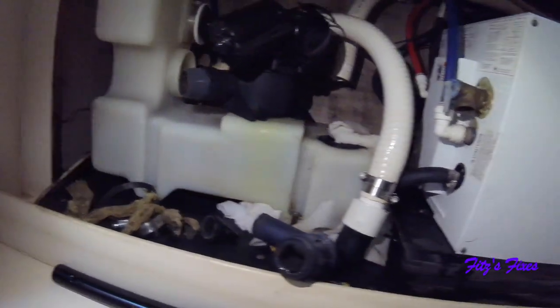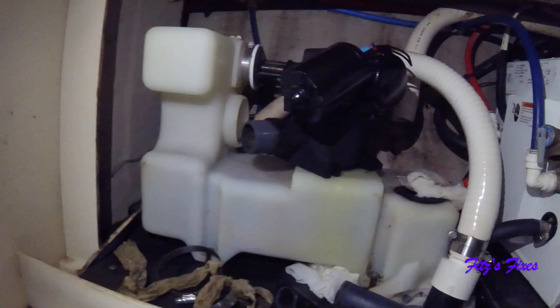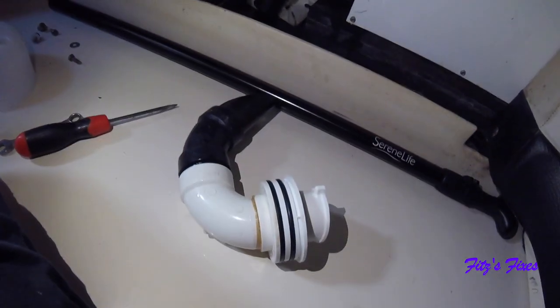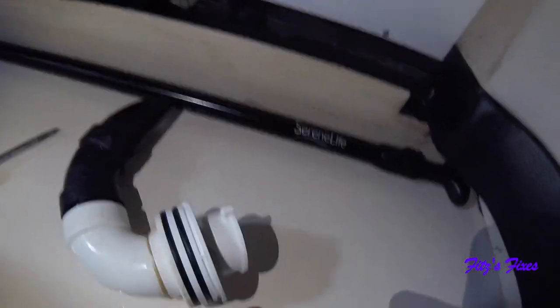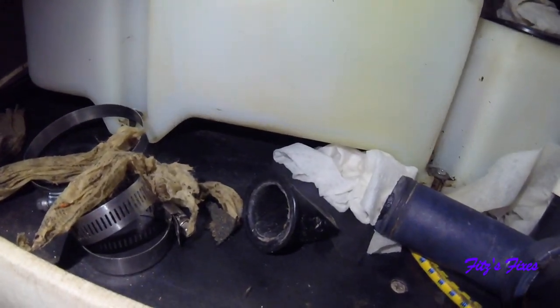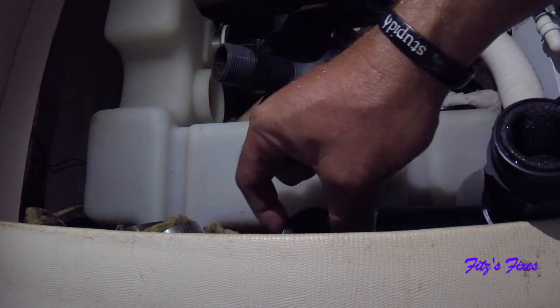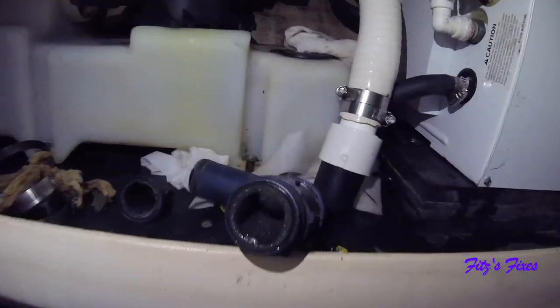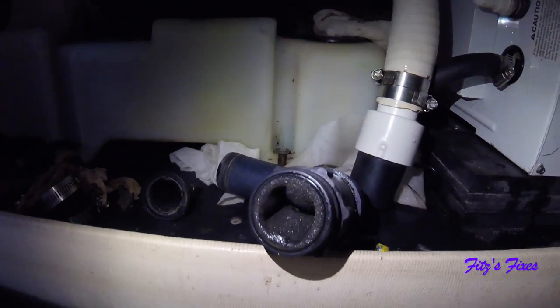If you're working on your toilet this is what you gotta see, so excuse the nastiness. There is some of the wet wipe that came out - I pulled it off and it was wrapped around the end here. That's the pickup, and it was shooting up and around and then in, kind of blocking off the duck bill valve. You can see why it's called the duck bill valve because it looks like a duck bill. A lot of this buildup is calcium - you get hard water and urine and you're going to get calcium on it, and that was blocking the duck bill.